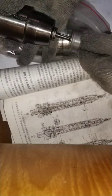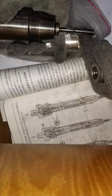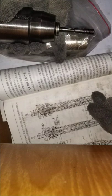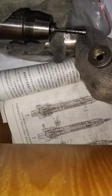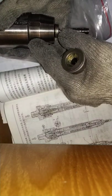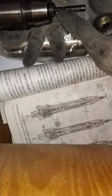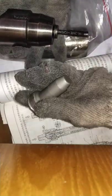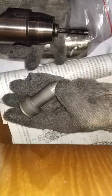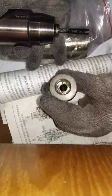The spindle is spring-loaded. So when we don't have an injection, the spindle sits in its resting position. When the high-pressure oil goes down, the spindle will be pushed up, forming a clearance that allows the high-pressure oil to go straight down through these three holes into the atomizer. This produces a fine oil spray.